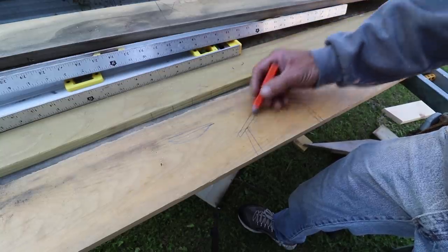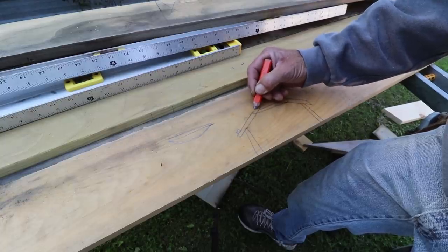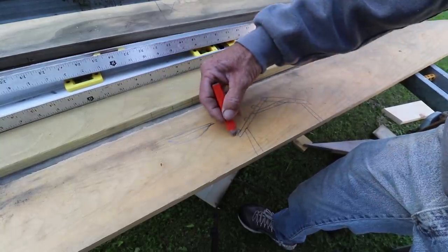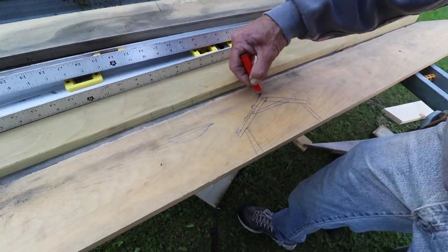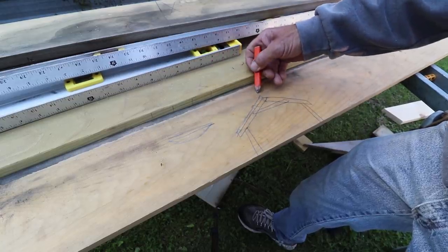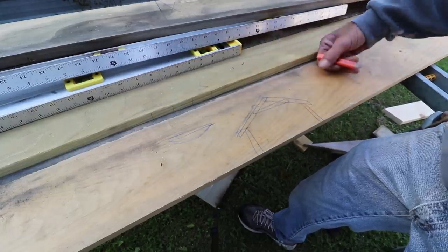I mean, with the steel roof, we're going to have these 2x6s, and then there's going to be a 2x4 every 2 feet going front to back, and then this metal roof will go on top of this. The metal roof itself can handle the snow load. It's just that if it gets too heavy here, can it push this down? And that's why you put the collar tie on it, keeps that from happening.